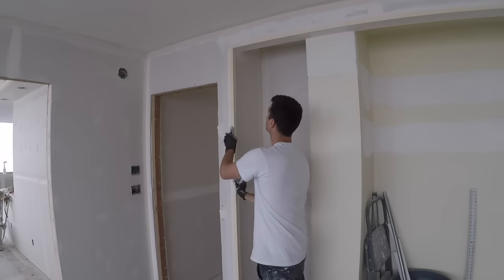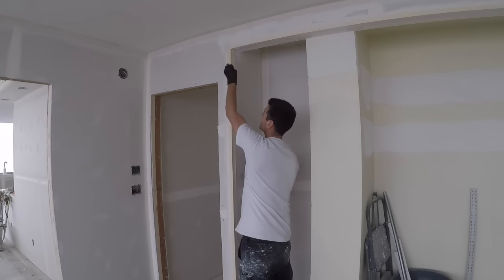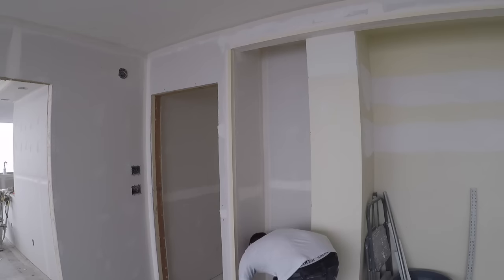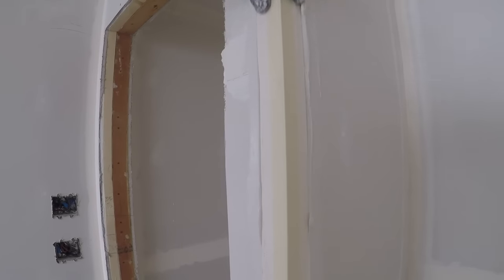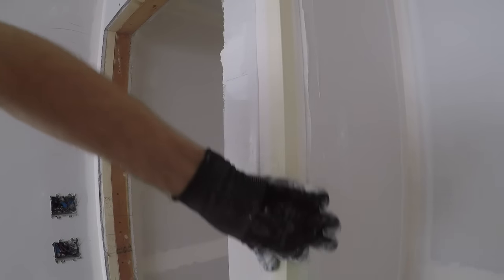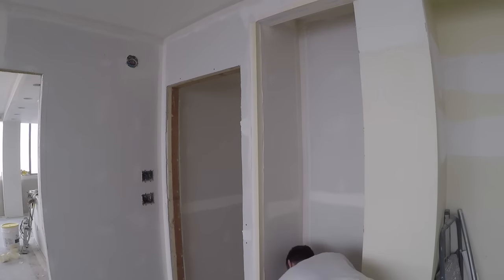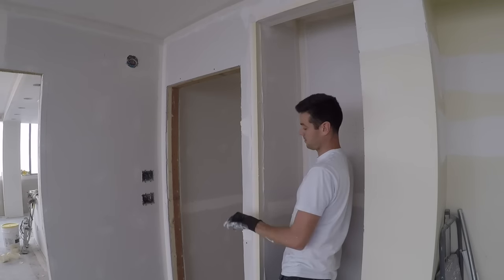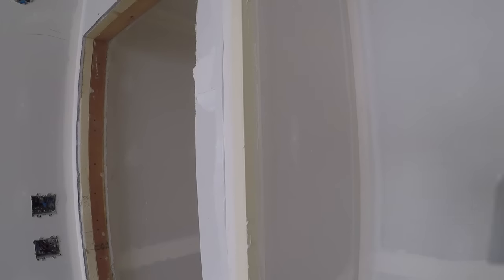Next I'm going to take my bead and push it up against this one. I'm going to be jiggling it slightly to help press it into the mud. Then I'm pressing up and taking my fingers to squish some of the excess mud out — but my fingers aren't going past the paper, otherwise I'll get mud all over them. Next I'm going to gently wipe out the mud, but not all of it. I want to leave some under so I can adjust it.